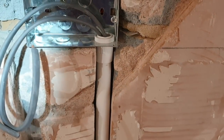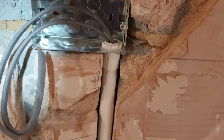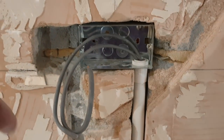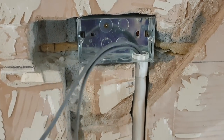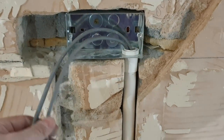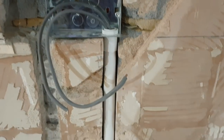And we would just clip the cables down there. I'll be honest, we did sometimes put a bit of bonding in there, but we would just clip the cables, we'd put grommets in, we'd chisel it all out. None of this grinding and using capping and that. And I never questioned it. It's not till later on in my career that I started seeing other people doing things, and I realized that just because someone's taught you a certain way doesn't mean it's gospel and that's the only way of doing it. And I've gone through stages of using capping.